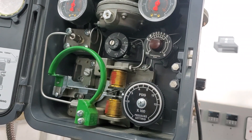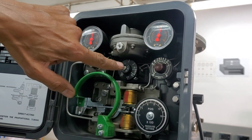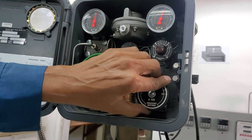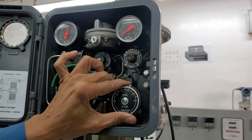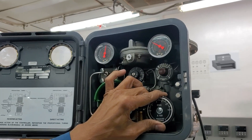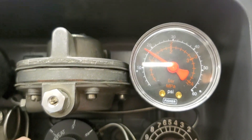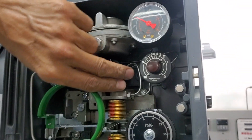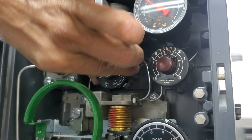I need to adjust the output on this controller to mid-range. My controller output is 6 to 30 PSI, so the mid-range is 18 PSI. I need to lock 18 PSI inside the reset bellows. To do that, I need to increase the output and keep adjusting until it is stable at 18 PSI.